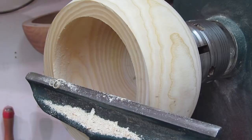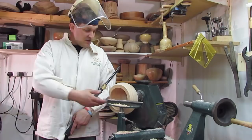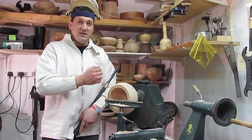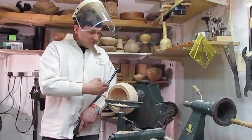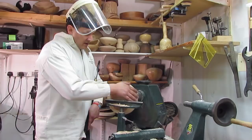So that's how I use the super ring — set it up, sharpen it, and use it either for a push-pull cut, a peeling cut, or a cut from a fulcrum outwards. All we need to remember is to work with the wood: nice slicing action, angle the tool down, pick up the sweet spot. You'll soon feel it. You don't need to apply lots of force. Keep the tool sharp, let the wood cut, and always work downhill. If you've got a slight undercut where the form starts to close back in on itself, work downhill from that direction. It really is as simple as that.